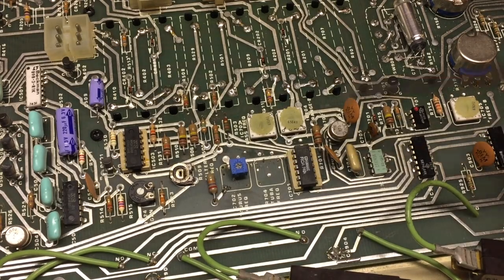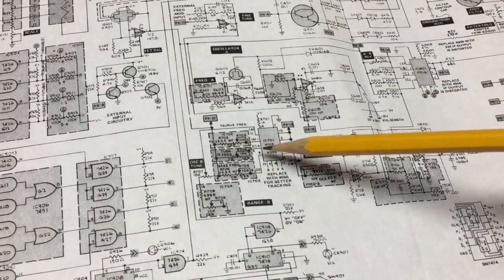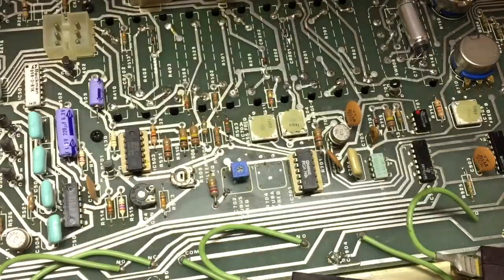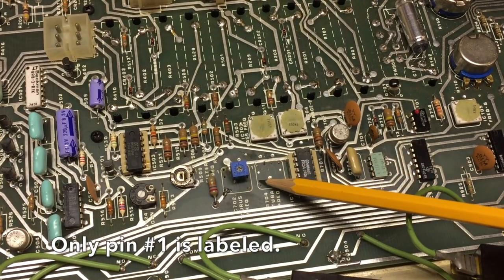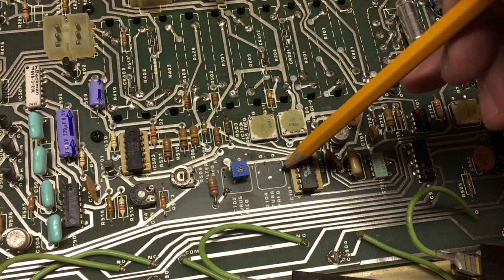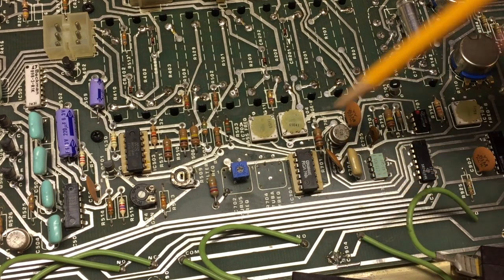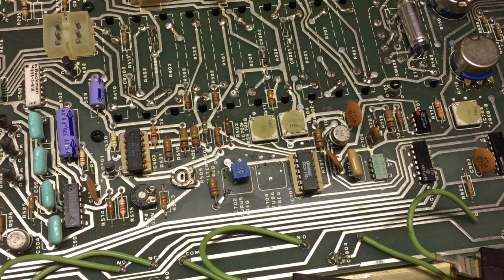I got it completely off. Now the pinning of these things — if you're looking at the schematic that's downloadable online, it'll say pin one, five, and then thirteen. Those pins correspond to one, two, three, imaginary, four, five, and then you've got to imagine six through sixteen. So in our case, we're dealing with pins one and five which are tied together on the other side, and thirteen. And we're going to put the new one in per the schematic.